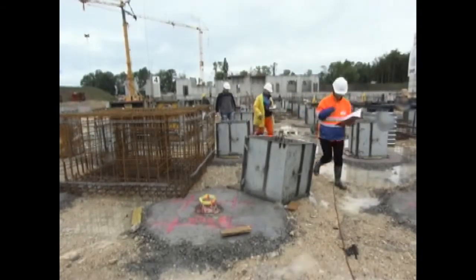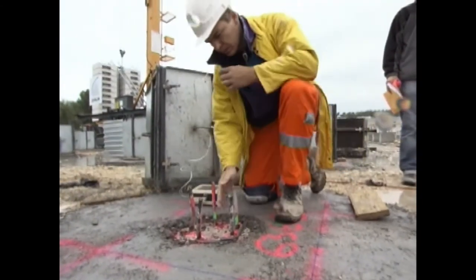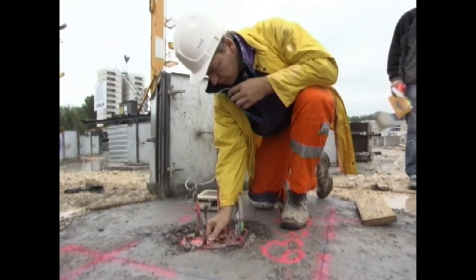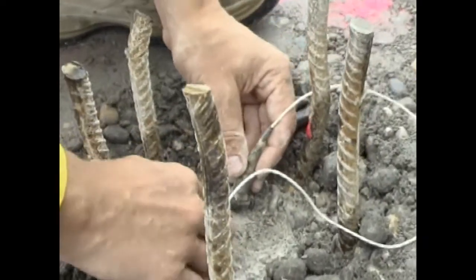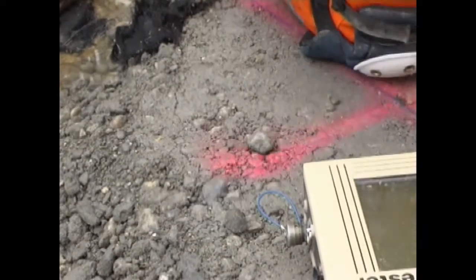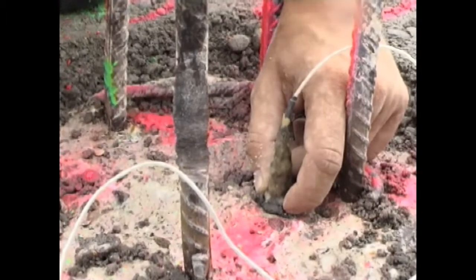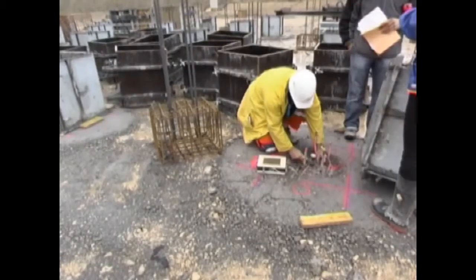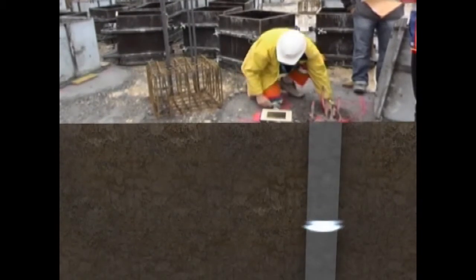In order to ensure the best possible quality of the foundation piles, extra controls were carried out in addition to the production protocols required according to DIN. A minimum of 10% of the piles were submitted to a low-strain pile integrity test. For this purpose, an acceleration sensor is fixed to the pile head and a shock wave is created with the blow of a hammer. This wave goes down the pile shaft as a compressional wave, and is reflected at inhomogeneities or at the pile toe.